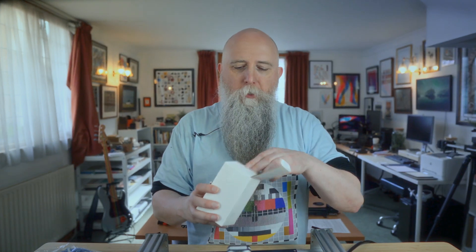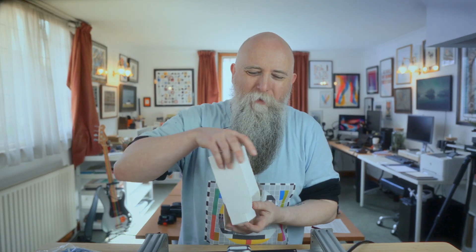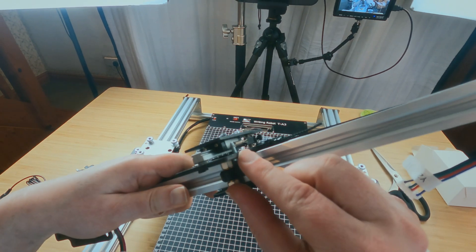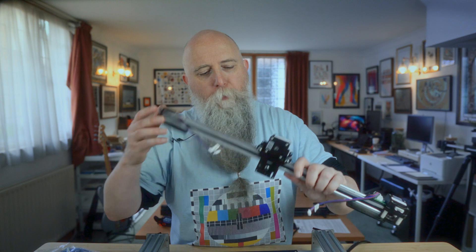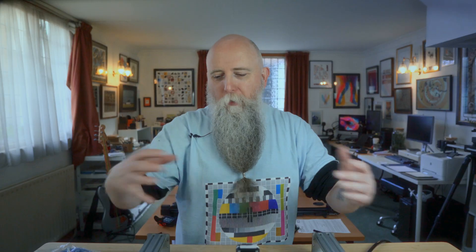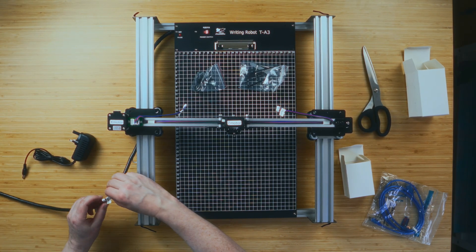Let's look at what's in the box: a pen holder, a bunch of cable ties, and a power supply. In here is a stepper motor — this is different to the servo used in the AxiDraw. The stepper motor means it should be a little bit stronger on the downward force, and you can do that because this is an H plotter. The advantage of having rails on both sides is you can have more downward force in the middle without affecting tension everywhere quite so much.